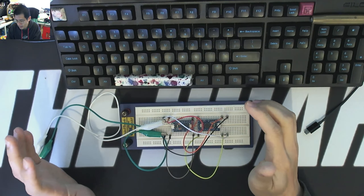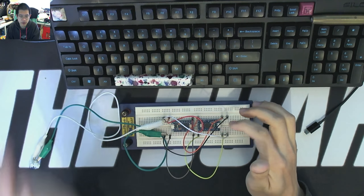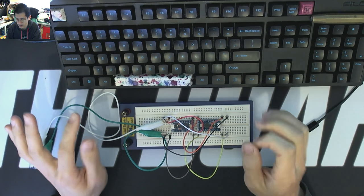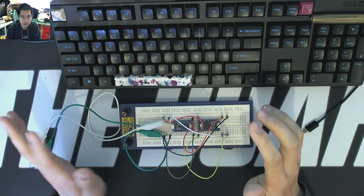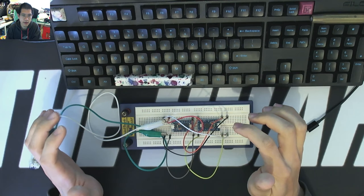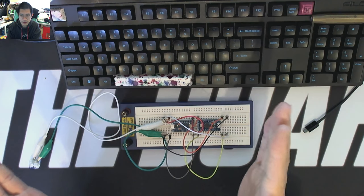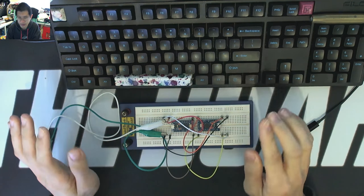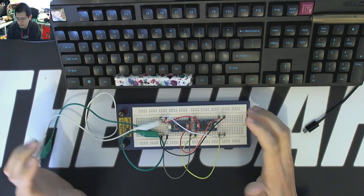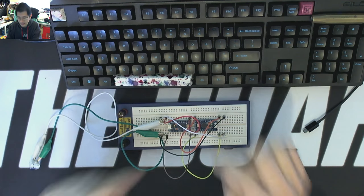I thought, I can't see why not, but it was a question of if it could be driven from one Pro Micro or not. And through discussions with people on Discord and the Australian keyboard Discord, the consensus was it probably wouldn't work without a lot of different things happening, because USB protocol is serial, so it only talks to one device at any given point in time. If I had a splitter cable of some kind, no one was quite sure what was going to happen to that actual output and how it would communicate with the two different computers simultaneously. So the consensus was it would probably be better and easier to simply set it up with two controllers, which is exactly what I've done below.